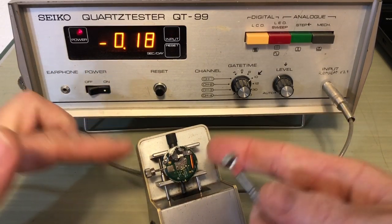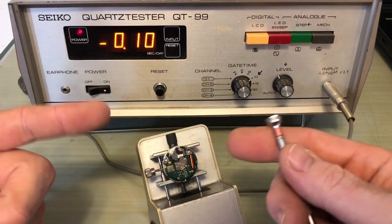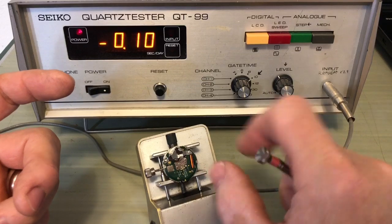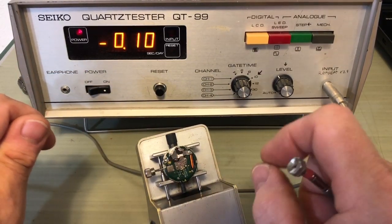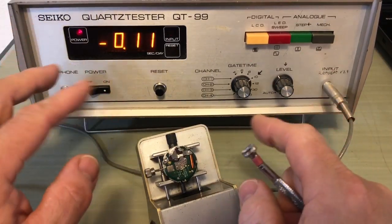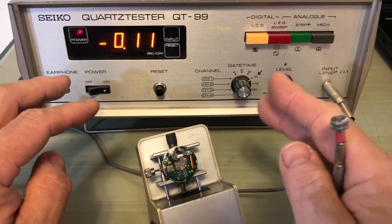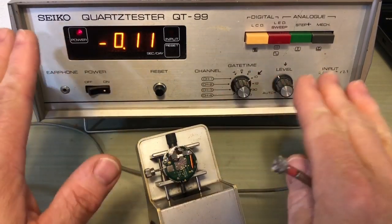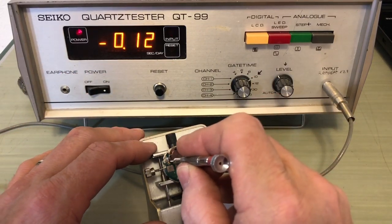That's what's great about these early high-end Seiko quartz movements. I mean, later on, like the Arnie and stuff, they have a little bit of a trimmer, and it does some stuff. You can change it a little, but it's like 2 seconds per. But it's not really fine, and then later on you can't do anything. And like the 7C movements that came after this, you only get 2 adjustments. You cut one wire or cut a second wire, and that's the only adjustment you get, and it's permanent. These things you can adjust and adjust and adjust.